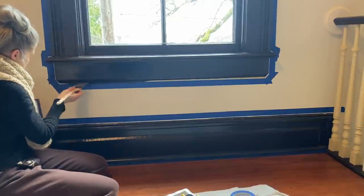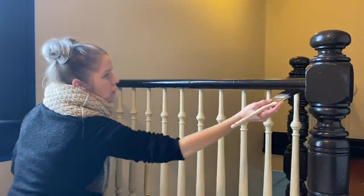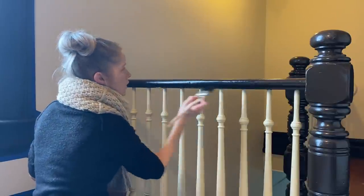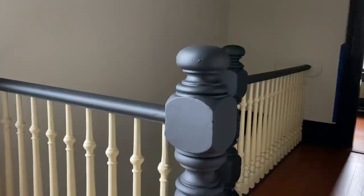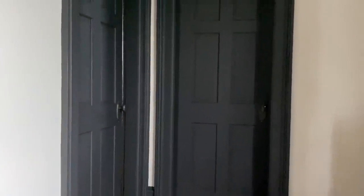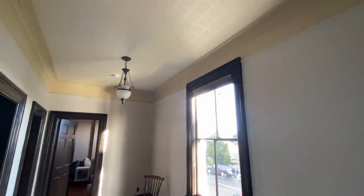Even knowing this is just an entryway, it has the most detail between the stair banister, the spindles, and the different colors. This is actually going to take me more time to paint than a lot of the larger principal rooms because of the type of painting — there are a lot of little tiny details. There is a sheen paint already in brown on the stair banister, and by using ultra matte you can avoid highlighting all those imperfections that sheen paint would show. So when you're trying to disguise imperfections, ultra matte is a great alternative.